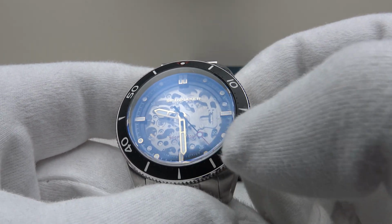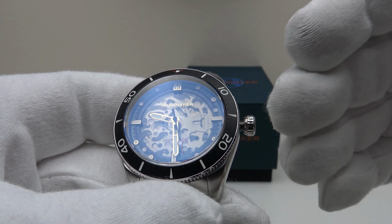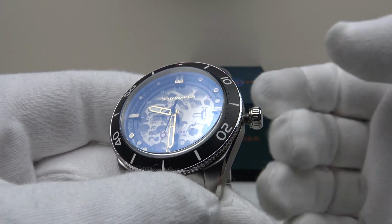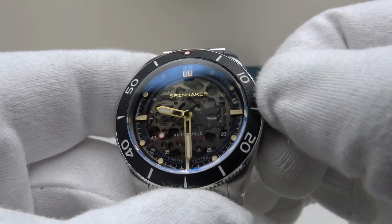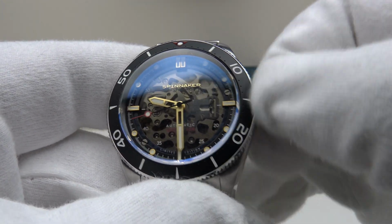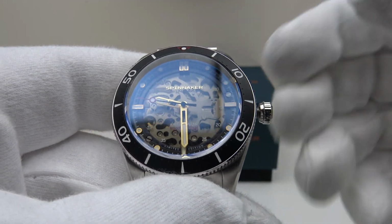The Seiko NH70 has a characteristic pop, as do all NH series movements such as the NH35A and the NH38, and that pushes the winding stem out of the movement into the first position, which is the manual wind position. So I can manually wind the movement to top up the NH70 to its maximum 40-hour power reserve. Absolute pleasure to feel the tension building up in the mainspring.